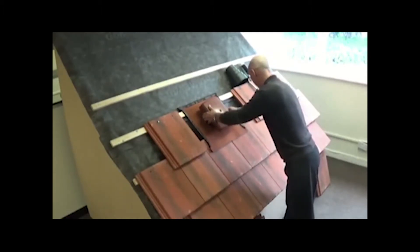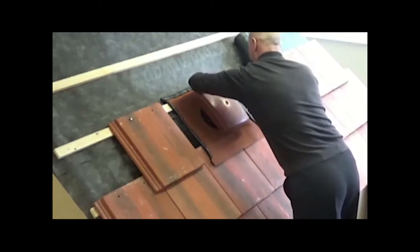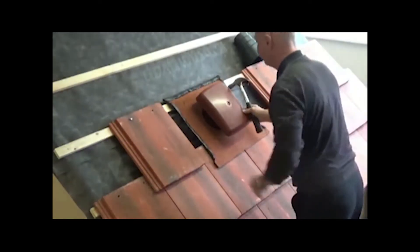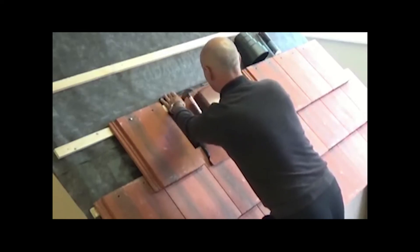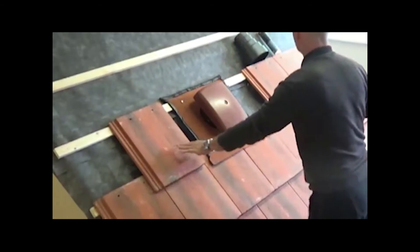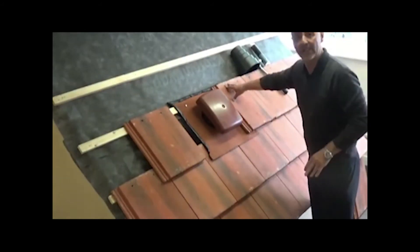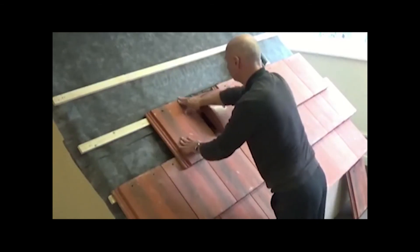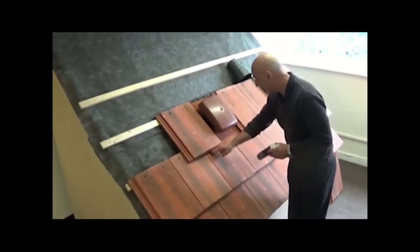The unit is positioned onto the roof and nailed securely. The tiles are fitted to the sides, and the unit is fixed mechanically on both sides as required by BS5534. Using the hi-tack adhesive that normally comes with the system, run a bead about 25mm behind the leading edge to keep it stuck down and stop wind uplift.